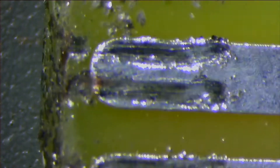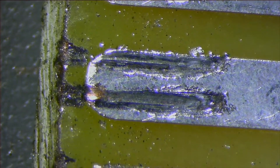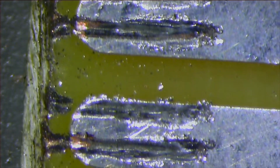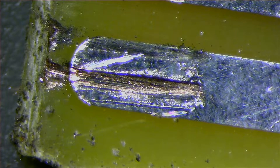And finally, our last board — 1,000 cycles for the JLCPCB HASL board. That looks terrible. Not only does it look bad, I honestly wouldn't want to put that in my Vectrex. That trace is gone — that is all the way through the copper down to the fiberglass. You can clearly see it right in the middle there — just wasted. This is what you get after 1,000 cycles: it completely wears through HASL, through the copper, down to the PCB. And over time, outside of your Vectrex, this is going to oxidize and it's not going to make good contact. This PCB won't function.